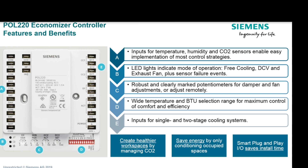Use the dip switches to set your temperature and enthalpy set point ranges. This is a standalone economizer, meaning it does not have a direct interface into a building automation system. The really cool thing is the smart plug-and-play feature — it knows what's hooked up to it. The first minute you power it up, it knows what's connected and adjusts the strategies accordingly. You don't have to figure out what mode it's in; it predetermines the mode based on the sensors that are hooked up to it.